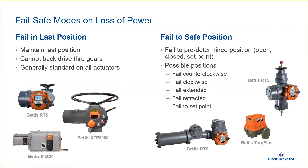For clarity, note that we are talking about failsafe in the case of power loss. There's also a function in electric actuators for emergency shutdown, or ESD. This is where, with main power still available, a signal is sent from the control room telling the actuator to go to its predetermined ESD position. This may be fully open, fully closed, or some point in the stroke. Obviously, with main power still available, stroking to an ESD position is an easy proposition for an electric actuator.